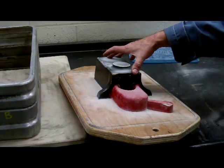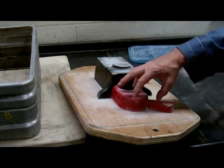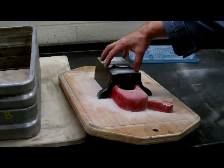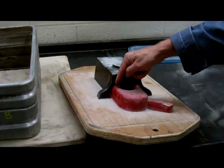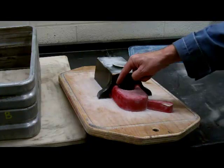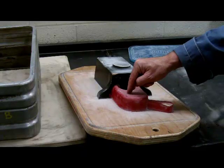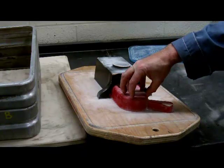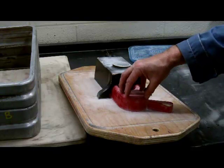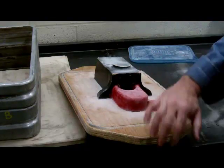What we're doing is creating a void in the sand. What we have here in red, we need to make a pathway to get the mold material into the casting. We have runners, and where they meet the casting at the black part are called the gates. This is called a well. When the mold material hits the bottom of this, we have a little turbulence and any foreign material will be caught in this part. It also acts as a reservoir for the casting.